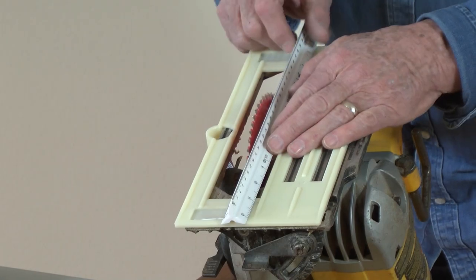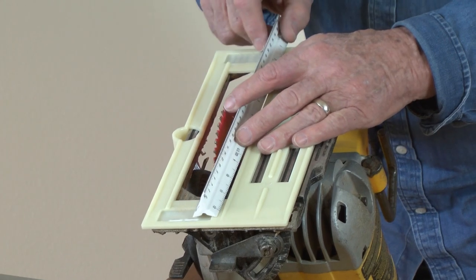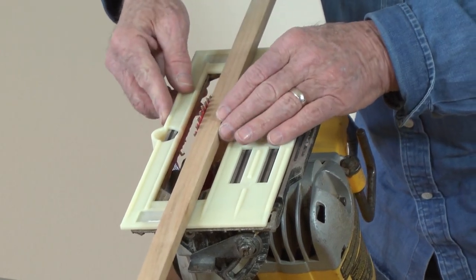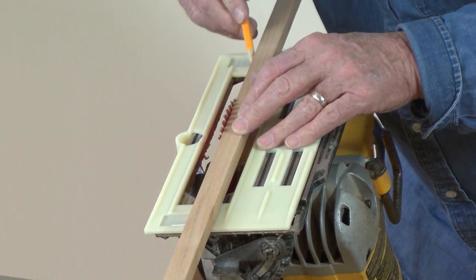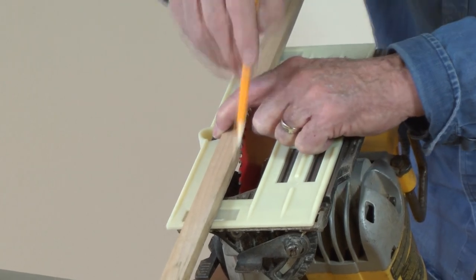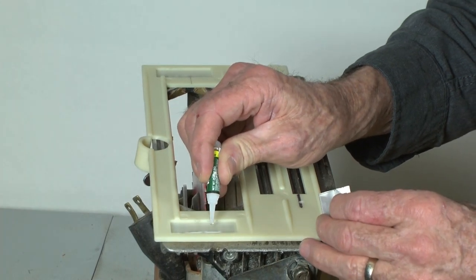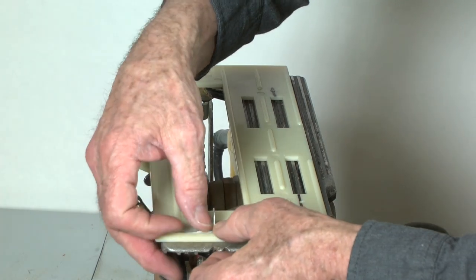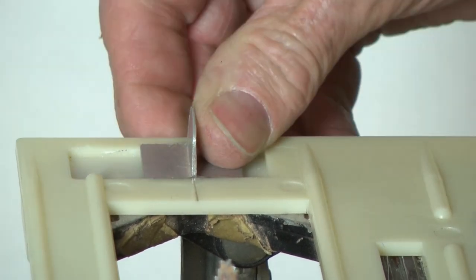Next, the ends of the saw blade must line up with the guide fins in a straight line. Rather than using a ruler — which can give an offset due to the alternating angles of the saw teeth — a much easier way is to use a straight piece of wood firmly pressed against the side of the saw blade and then mark the ends with a pencil. Put the wood on the other side of the blade and make two more pencil marks. Apply a dime-sized drop of super glue where the pencil mark is, line up the guide fin with that pencil mark, and press the guide fin firmly into the adhesive. Do the same process on the other end, firmly pressing the guide fin down into the adhesive.